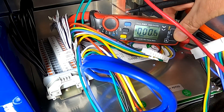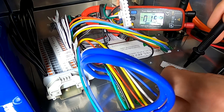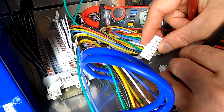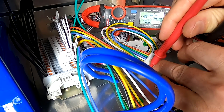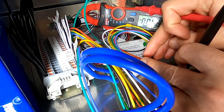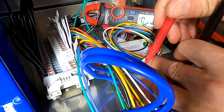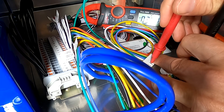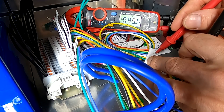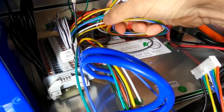Now doing the same with the second connector. With my negative probe staying on the negative contact of the first connector, I go through all the contacts of the second connector: starting at 29.5, then 32.8, 36 — but the white one here has no contact. Then 42, 45, 48, 52 — okay, just the white one, which is our cell number 10, has no contact.